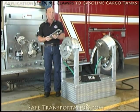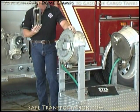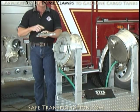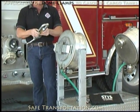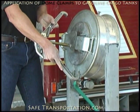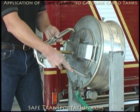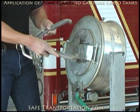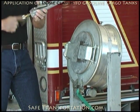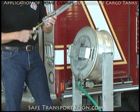The application of this particular clamp — something to keep in mind — is that when you take it out of its container, and when you take any clamp out of its stored position, it's typically going to be in the fully locked down position. So when you come over here to apply this, if you haven't loosened it up, you're not going to be able to get the edges of the hooks around the top of the dome lid itself. So prior to coming down to the cargo tank, loosen this up, open it up fairly wide, and then when you come down here you'll be ready to make application of it.